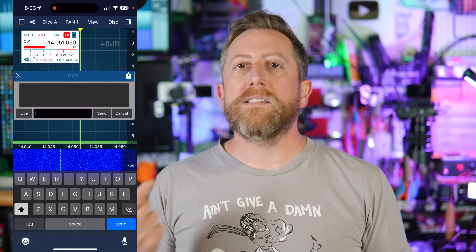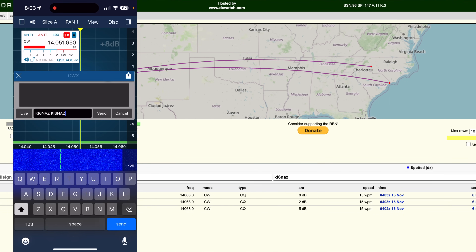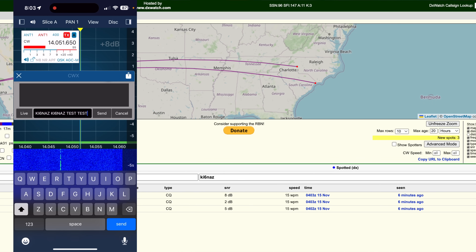Having a direct way to key the radio on and off, like QSK — which is a type of way of actually keying your transmitter — doesn't really work over the internet as well. So there are myriad ways of facilitating Morse code remotely, but a lot of people end up using a keying device within the SDR control application. It brings up a little window, you type, and the radio keys out the characters — it can take a J and turn it into da-da-da. But then you lose some of the feel of doing Morse code.